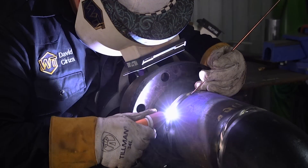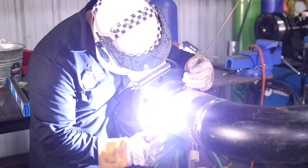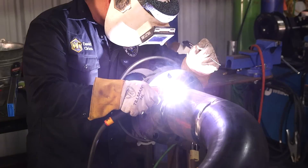Just a steady, smooth walk and feed. Same thing on this quarter — what you would kind of see in a fab shop, you're just going to be welding and welding. There'll be a lot of rollouts. It's important when you're walking the cup — you don't want to be sticking out too far and create too much of a puddle. You also don't want too short of a stick out on the tungsten, sitting in the bevel trying to reach down. You're going to be cutting your wire instead of creating a puddle and moving it forward.